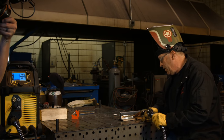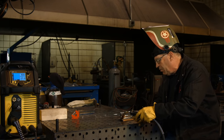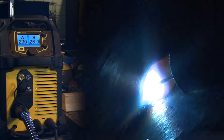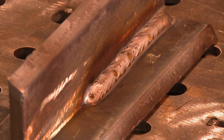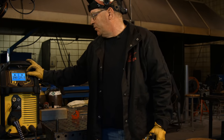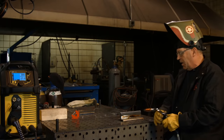I'll do this weld half and half. I want to push this away from me for the first half of the weld, going about 10 degrees forward. The second part — for camera angle — I want to pull it back toward me, same lead angle and everything. Let's have some fun. Pretty nice reaction there — just a little bit of crackle going on. Arc length might be just barely short. Let me go down five inches a minute in my wire feed speed and see if we can soften that up.